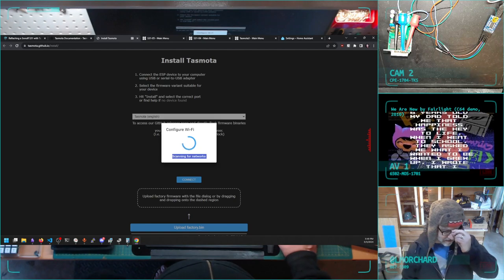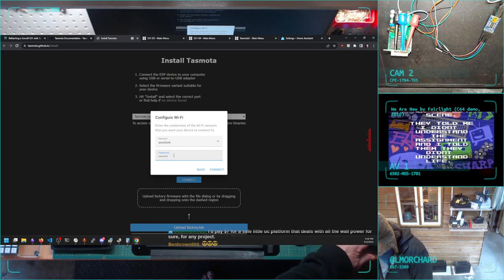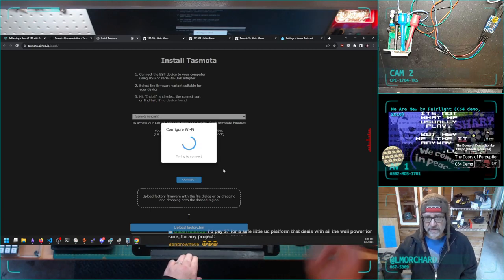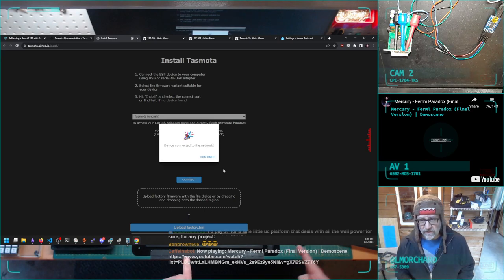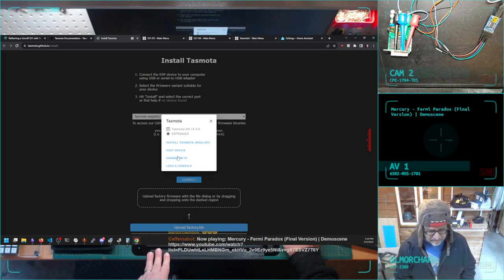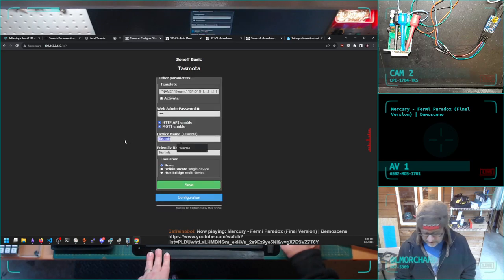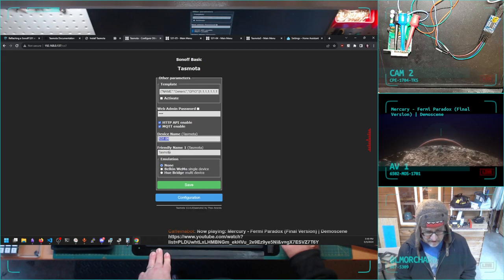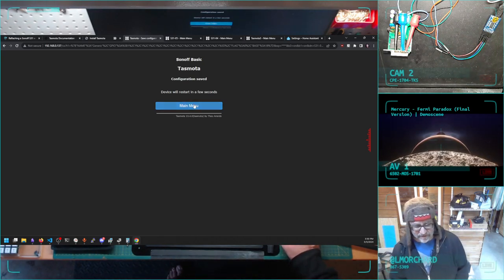Now I'm going to get on my Wi-Fi network. That is the one downside of this, if you change your Wi-Fi point, you gotta reset all the passwords. I think there's a procedure for it where it's something funky, like you connect it to a power strip and you flip the power strip on and off 7 times and it resets to factory defaults. And I think at that point you can connect to a custom Wi-Fi SSID on there and do all this with a smartphone. I'm doing it this way because I'm connected with serial anyways. So, okay, this is S3106. It's the sixth one I have. Save that. That's also annoying because it reboots after every reconfiguration, but whatever. Just a little guy.